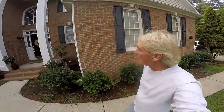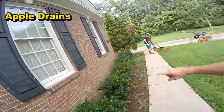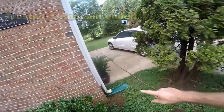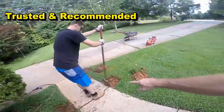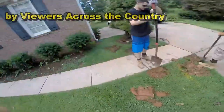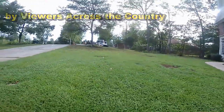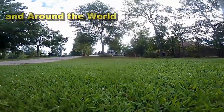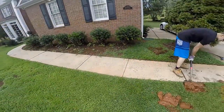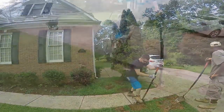We're also going to be hooking up a downspout here. We'll come around behind these bushes, pick up this downspout right here, cut the walk right here, and send it across. It'll run actually underneath of our channel drain because we're going to add a few more catch basins along this section. There's a pretty good sized hill that comes from the street down this direction and that water just floods all over the place, so we're going to capture that and send it to discharge all the way out to the back.